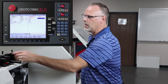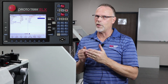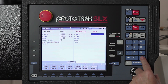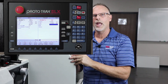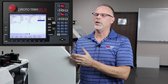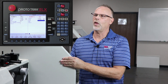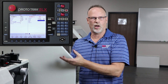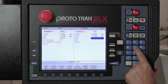There's a reason why the head may be expanded on the way out during the transition, so I want to make sure I have enough room away from the part for the tool to come all the way out before it tries to go home. I'm gonna use a larger Z-rapid — a quarter of an inch — just to make sure I've got plenty. I'm going all the way through at minus 1.25, which will get my full tap through the hole. For the pitch, you take one divided by the number of threads per inch — this is 16 threads per inch, so that makes it 1/16th, which is 0.0625.